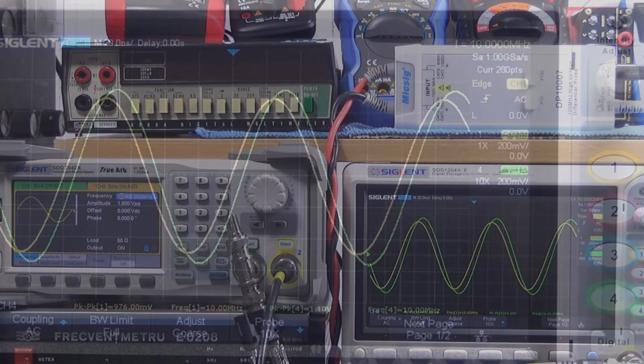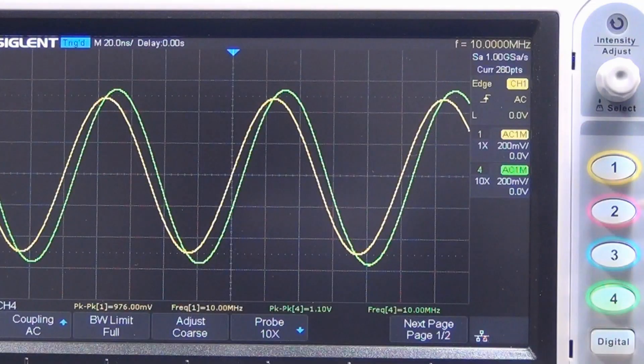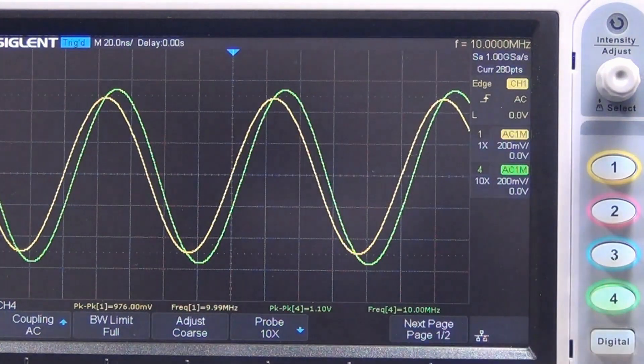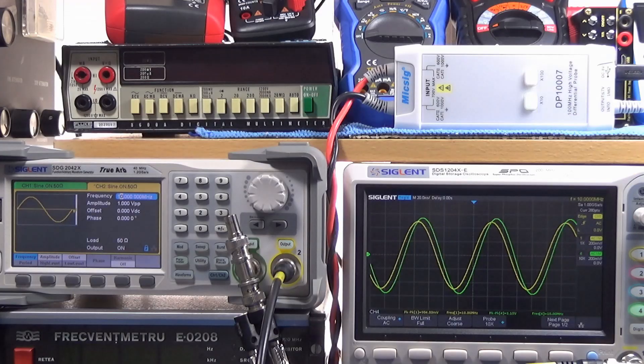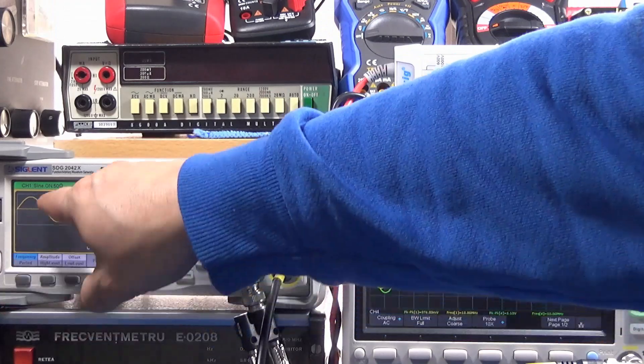Because of the cable characteristics, I'm getting a little bit of loss in the signal on the input, and a little bit of gain on the output. There is also a little bit of phase shift — the output signal is lagging behind the input signal. Let's skip ahead and jump to 100 MHz.